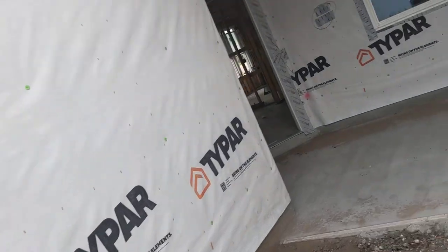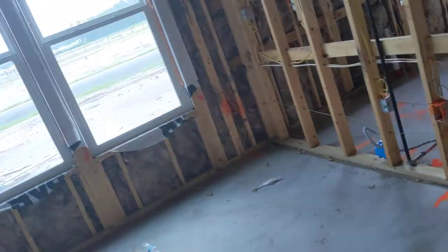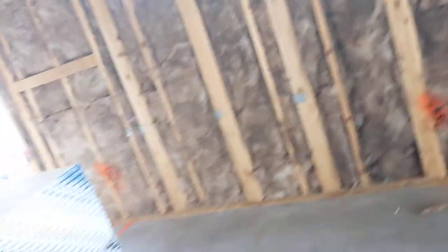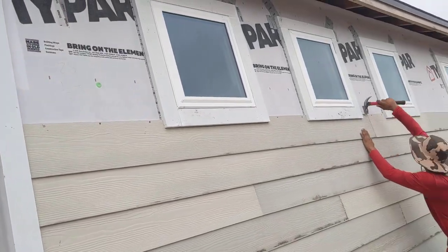The concern is whether their fasteners might strike a water supply line. I tested here to make sure we had water pressure coming out, so I know we've got pressure everywhere. I'm just walking around now — no siding goes over here of course, there's the firewall. The plumbing in the kitchen is off the wall; none of their fasteners are long enough to hit it. As these boys progress with the siding, I'll periodically come in and look for a wet spot on the slab. Once I feel we're high enough with the siding, Eric will send his crew to start hanging drywall.